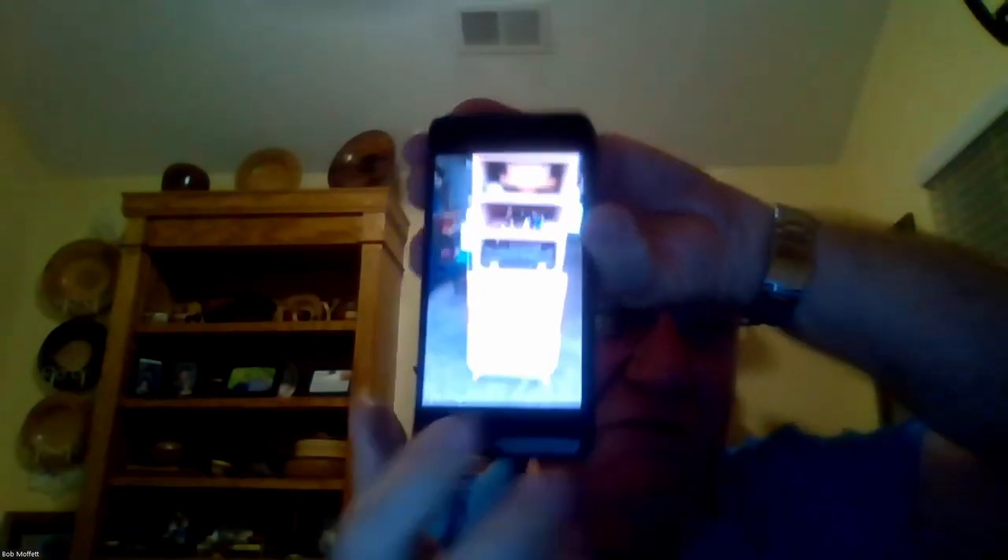I've got one I'd like to show — it's on my phone. I took a two-drawer file cabinet, made a frame around it with plywood, and put tools on each side. One side each has tools, the back has sandpaper, and the front has the file cabinet drawers plus three shelves that pull out. You can store almost everything in it. It's 15 inches wide, two feet deep, and about four feet tall, and it's got wheels so you can roll it out.